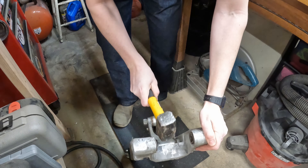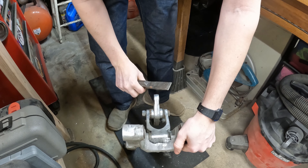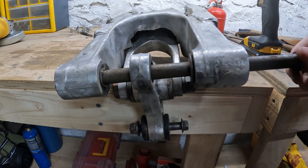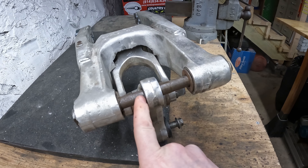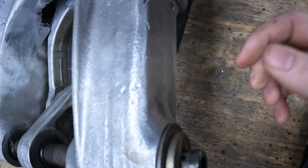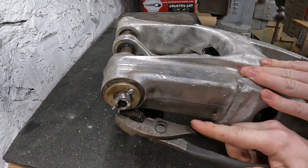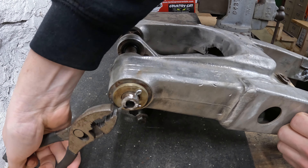This is actually just cracking. Now I got this linkage how I want it — what I did is I popped this shaft out a little ways, rolled electrical tape around it, and pounded that in there. Then I cut off the end, put a washer on, and I'm just going to put a cotter pin through there and bend it over to keep that pin in there. This will be a nice place to mount the seat.